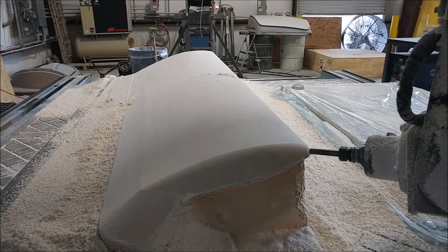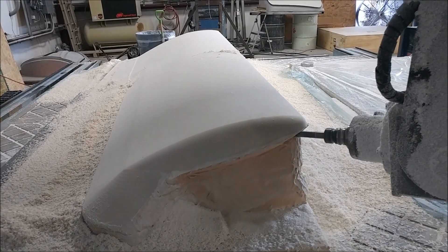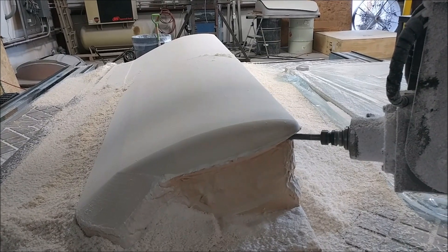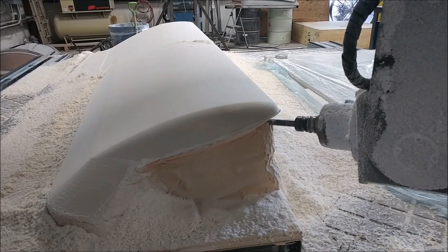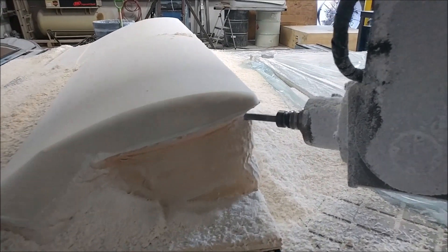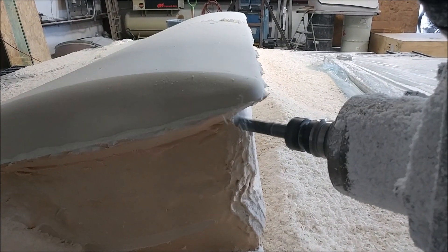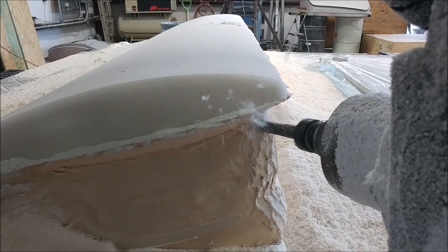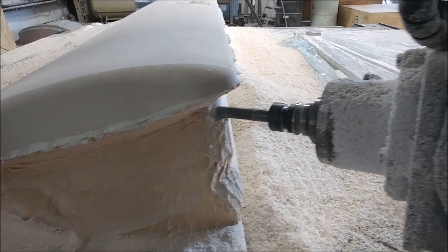The right side upper fore-plane skin has been sprayed with putty, and as you can see quite a lot of it's already been done. Just working on the side flange now with a short flat end mill. A little bit more to do after that — need to do underneath the leading edge as well and finish off some of the other areas with the ball mill.